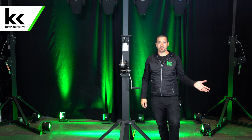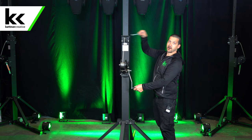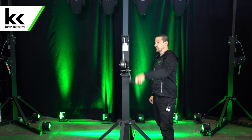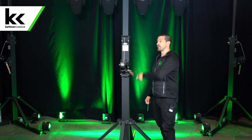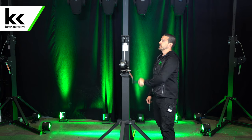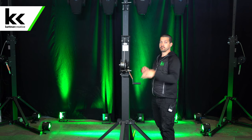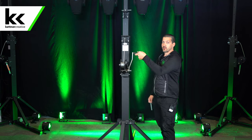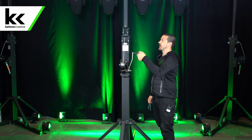To lower it, take the crank, lift it up, take the first pin out, and lower it down. Each stand will take 500 pounds, so if you have a piece of horizontal truss, you can do 1,000 pounds as long as you're lifting level. Anybody that's taken a rigging course knows that if there's any rake in the truss, that throws the math way off.